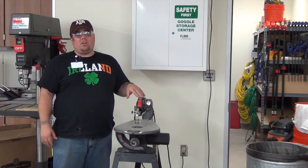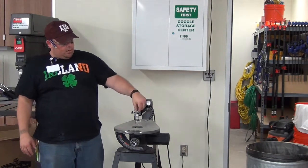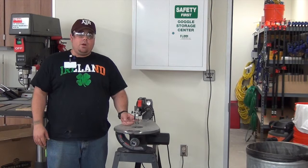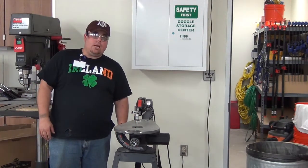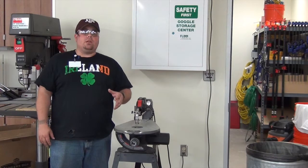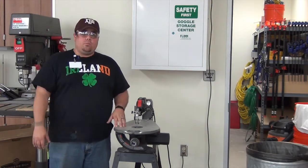The speed is going to be based on your material and how tight you want those curves to be. To change our blades, there's a lock right here which, once you pull it up, relieves the tension on the blade, because this blade needs to be pretty close to banjo-string tight. There's a locking nut here and another one down at the bottom. If this blade were to break or you need to change blades and you're not sure how to do that, find a facilitator or shop aide and we can walk you through that process. You're going to need to see us for blades anyway.